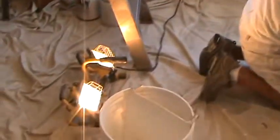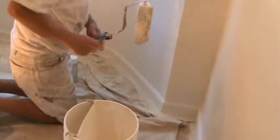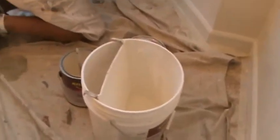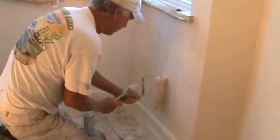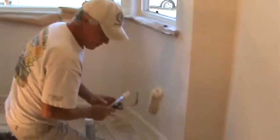I know you've seen me do it with a little paint tray, and I've done that for all kinds of little projects — but you can do it this way too. Jim does it this way all the time because he's set up that way. If you're not set up that way, do you have to go buy a five-gallon bucket and a paint strainer? No. If you've got just one little wall to do or a little project, you can get the paint tray and do that. And if you decide later on, hey, I kind of like painting, you can get your paint bucket and a strainer. You can put more material in a bucket and you have less spillage. You pour the paint in and you don't have to stop and fill your tray again. And it's recyclable — you can use it over and over.